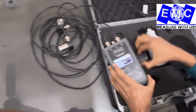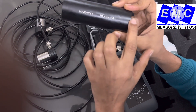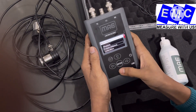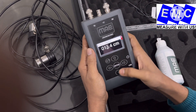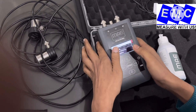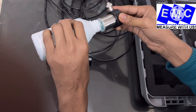First of all, see this calibration bar. As mentioned on it, 50.4 microseconds is the reading of this calibration bar, and the distance of this calibration bar is 12 cm. So first of all, we will set the probe distance to 12 cm. Here I have set 12 cm probe distance. Now I can take the reading. Now I am applying couplant to remove the air gap.